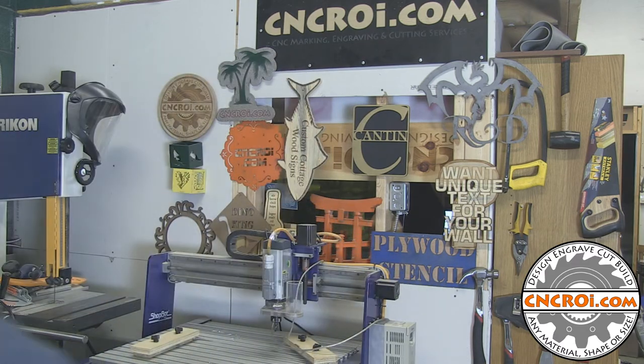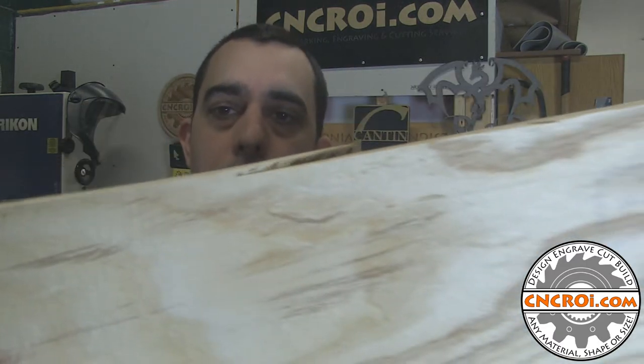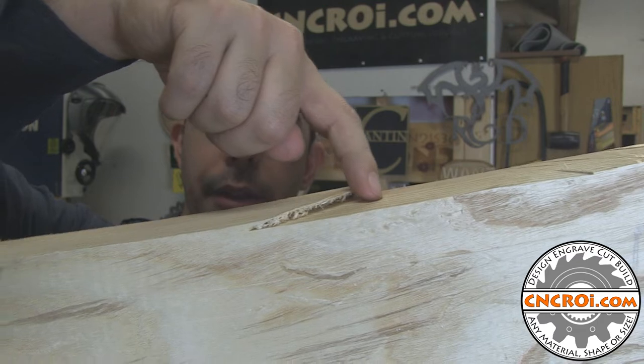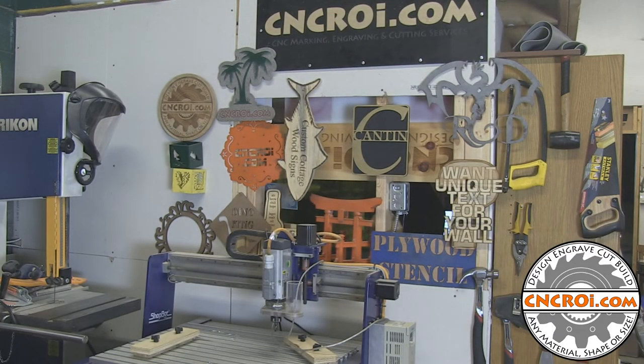All of this stuff is not enough power to cause any real issues with the wood. So let's actually look at the edge here. What happens is that it will do an amazing result here with the laser. And then because the focus changes, there is no two-way feedback system for focus while it's working. The engraving actually happens less deep or more deep, or what happens is you get a lot of smoking and not engraving, or very inconsistent results.